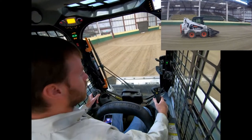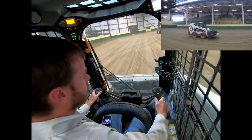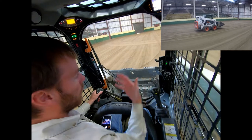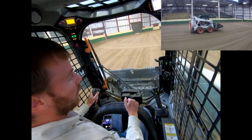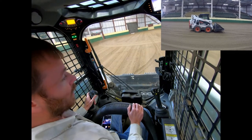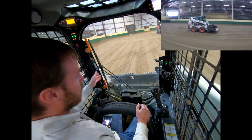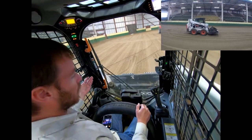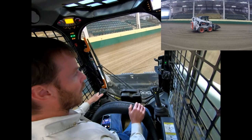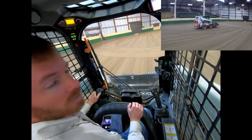We can now back up, go forward, and easily go in a pretty tight circle — then level it out. It's very easy to go back and forth, and while we're going back and forth, we can operate that bucket simultaneously. If we wanted to be moving dirt, we can easily drive forward — it's a variable speed. The further I push that joystick forward, the faster I go. If I just want to creep backwards, I can barely pull that joystick back and go super slow. You can also spin 360 degrees with this skid steer, though doing so a lot will tear up ground.